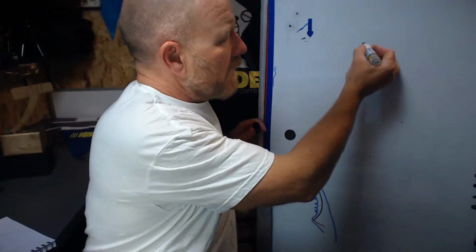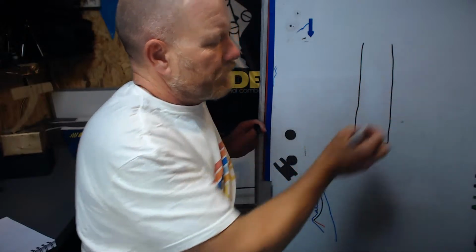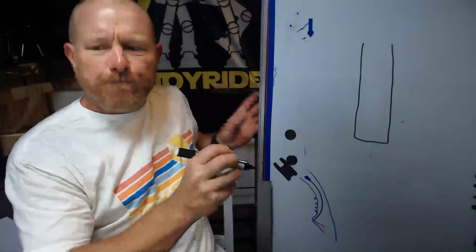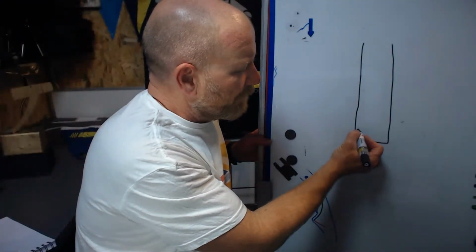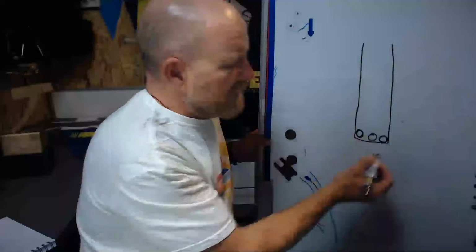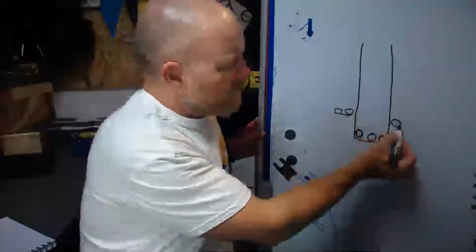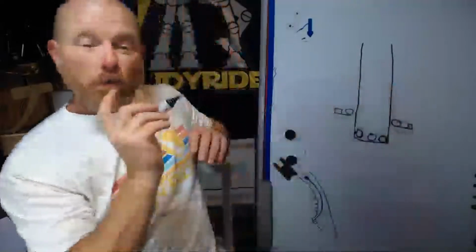This is a bit of a test. Can I remember? So if this is the bottom part of the mast. So this is going to be a kind of copy of the Cunningham system on Bad Boy 94, the Tornado. So what we've got here at the bottom is 3 blocks. I'm drawing them this way because it's easy. We've got cleat, same on this side, block with cleat. And then we've got more.